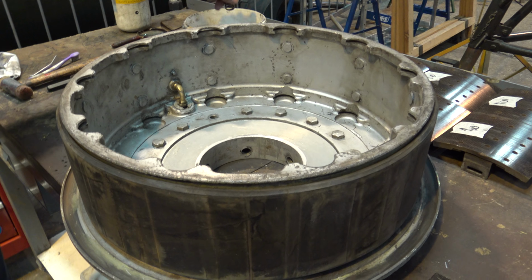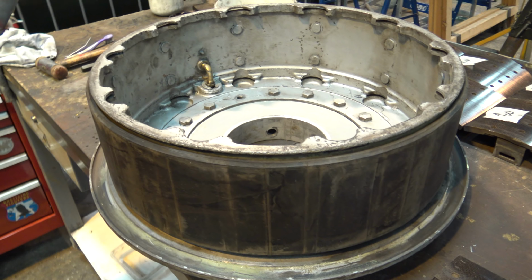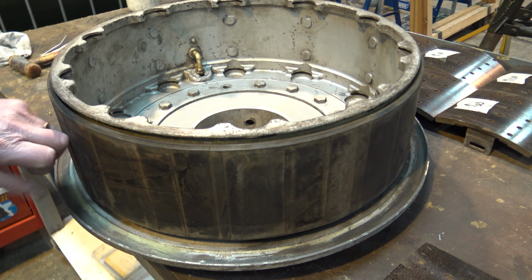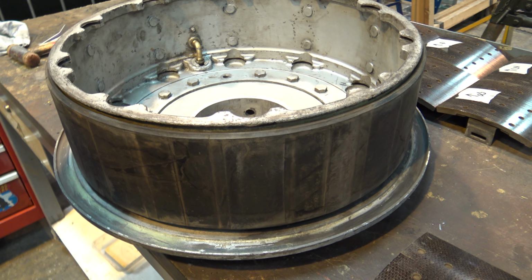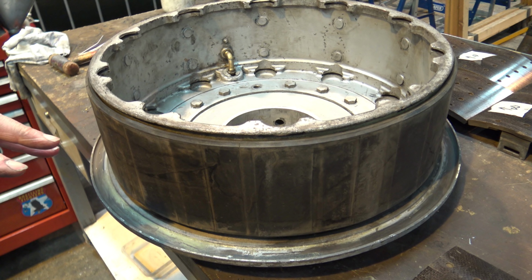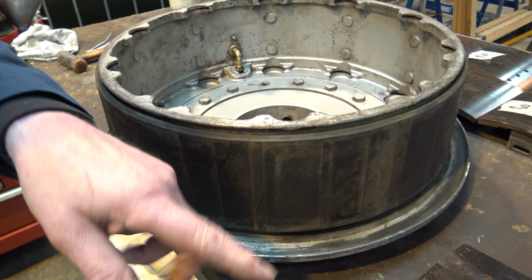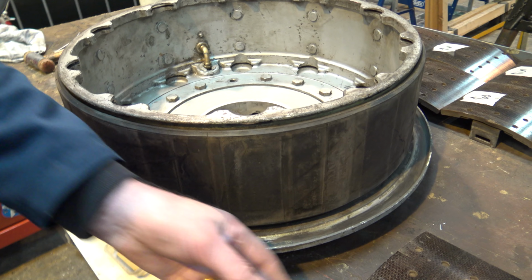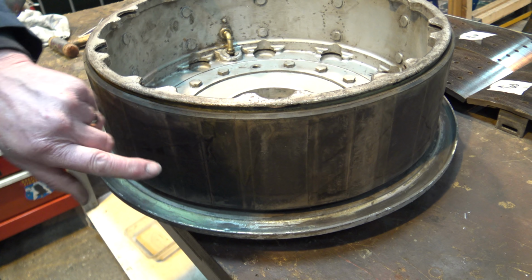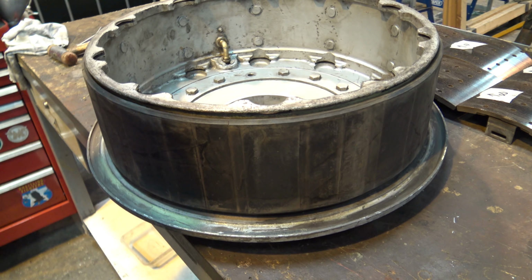Well, very simple idea, isn't it? Very simple, yeah. Generally very reliable. The only problem is if these become age hardened, or when the brakes are hot, if the pilot leaves the brakes on, the heat from the brake drum builds up through here, it's transferred to there because you haven't got an air gap, and then eventually it can cook the bag. I see.